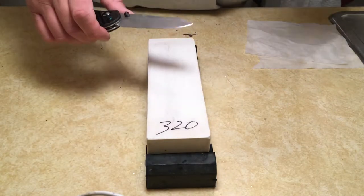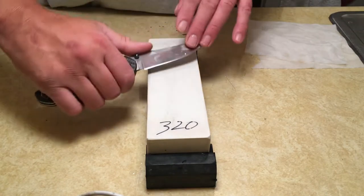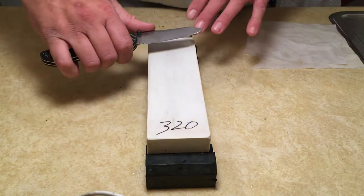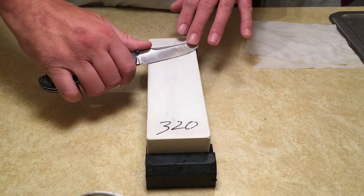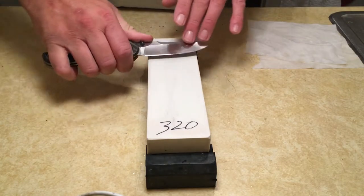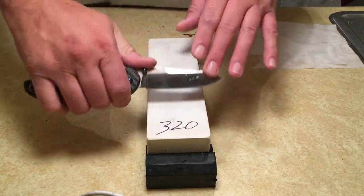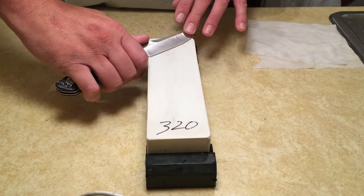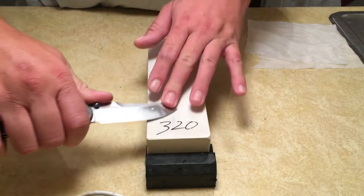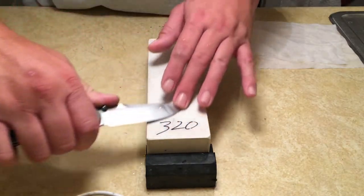And you can also do it however you feel comfortable if you want to use both hands. I always recommend using both hands. It helps keep the wobble out. So we're going to put the knife at a 45 degree angle. And it doesn't have to be exactly 45 degrees. You can be off a little bit. You can be up here, you can be down here, just as long as the knife has a larger area of contact than going perpendicular. If you're going straight on, like I said, your hand is going to roll. So find what's comfortable for you, find that angle you want, twist into the stone at that angle, and start to sharpen. If you want, you can sharpen the knife entirely with just long strokes like this.